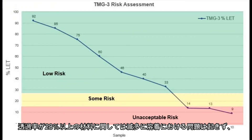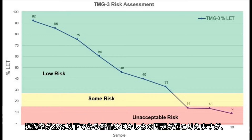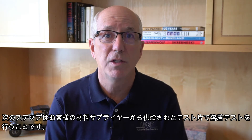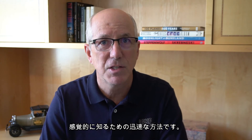Materials that transmit more than 28 percent of laser energy seldom have a problem welding, and are easily welded, creating robust, hermetic bonds. Materials that transmit less than 28 percent of laser energy are more susceptible to surface burning of the cover before the parts are completely welded. Parts in this range can be problematic, but welding parameters can usually be found to produce a good weld. If the material has good laser transmission values, the next step is to perform welding trials on the test plaques provided by your material supplier. LPKF provides TMG laser measurements and test welds at no cost. Test welds are a quick way to explore the range of welding parameters to get a feel for how easy the material is to weld and identify any issues such as burning, incomplete mixing, and bond strength early in the process.